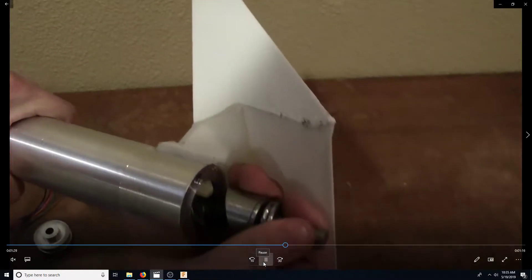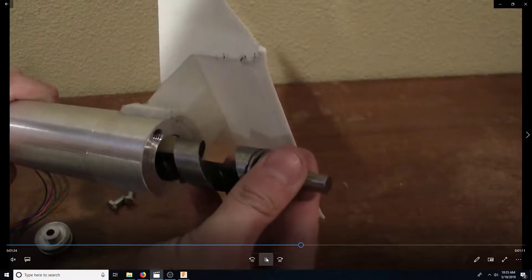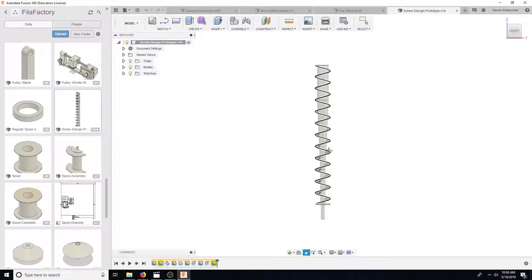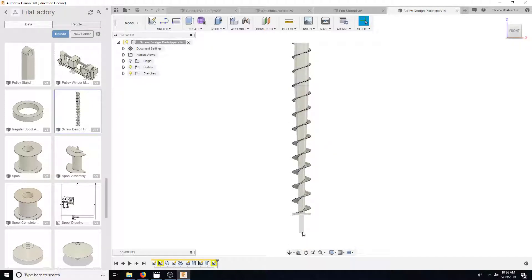As that pressure changes it'll vibrate the filament diameter — that's what causes a lot of inconsistency. Here I'm pulling out the regular metal auger screw used in the Multi-Shooter. The Fill Factory is going to have a high-performance screw, which I have here — super excited to use it, but I need a fourth axis. This guy is the variable inner diameter screw — we have a small diameter here to let pellets in, and then it compresses three times its volume. The volume decreases by three times, compressing those pellets against the wall more and more.